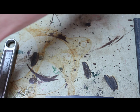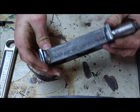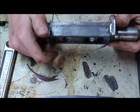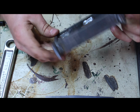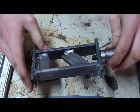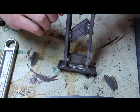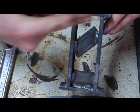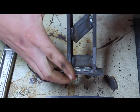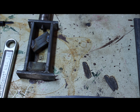Let's take a look at the top die, my bad. The top die is even more interesting. If you look here, we also see mill scale has been peeled off here, here, here, and here. So what this means is that this whole quadrilateral frame has been racked into a diagonal shape.